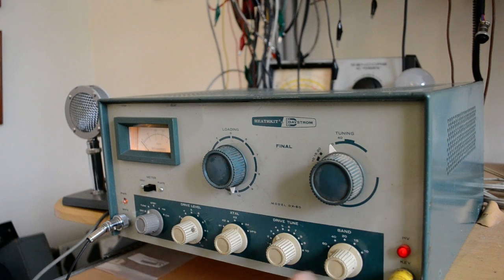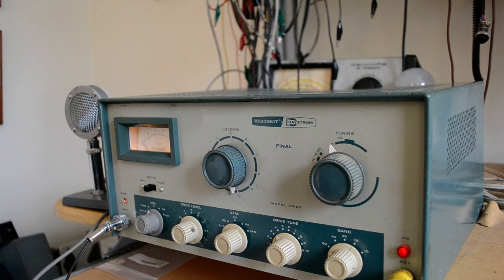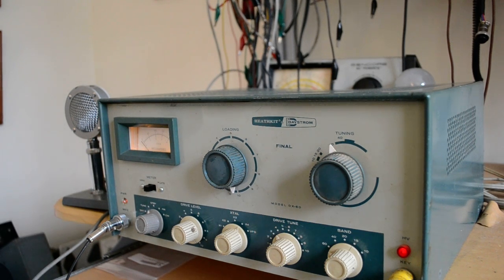I guess there was a problem with this light over here, and when I got it, it was arcing. The screws that he put in here were the wrong type of screws. The lights wouldn't light on the meter. Wrong type of screws again. He tried to use machine screws where you should have used regular screws. So all of that resulted, if he had put the switch in right, which was not easy to do. Putting in the switch was difficult, the way it is set up.